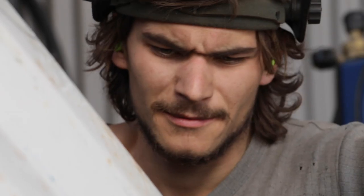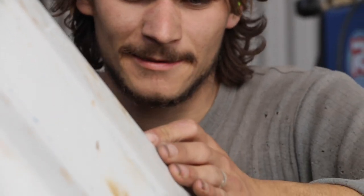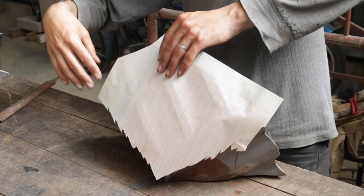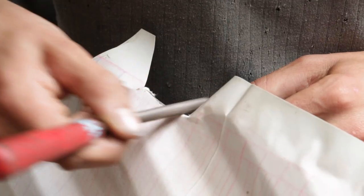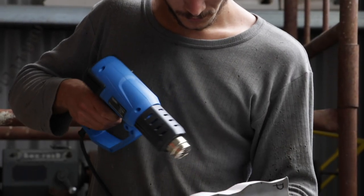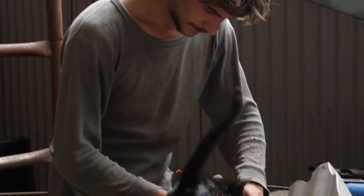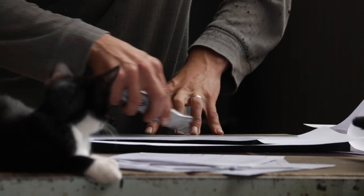I experimented with an overhead projector, but it too was very long-winded, and I still thought there must be an easier way. Eventually, I came up with the process of wetting a piece of paper, smoothing it over each face on the model one at a time. I would then run round the edge of this face with a file which would cut out the exact profile. Then by marking the corrugation lines on it, removing it, drying it, and enlarging it on a photocopier, that would provide me with effectively a map or a template to lie over the big sheets of corrugation and then cut them out.